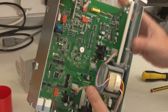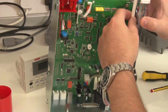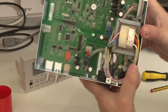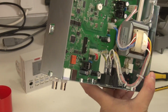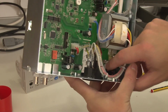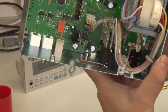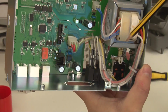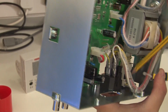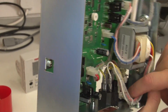Another thing they've done really well, I was just going to point out, if you look at the power switch here, it's actually on a plastic bar going back to a hard power switch in there. But something I really like, which you don't see done that often, is that switch is actually on a small little subboard, and then the power connector is going to it.